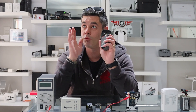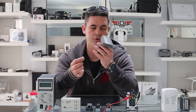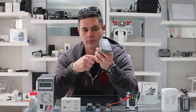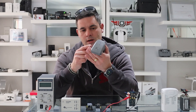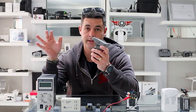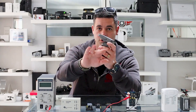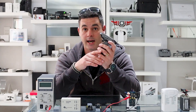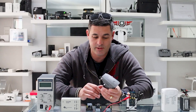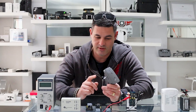Disclaimer: these are LiPo batteries. If you pierce a cell you will burn your house down, so please be super careful how you open them. Don't use steel tools. There are a couple of clips and sometimes a bit of glue — pop the battery open carefully. If you aren't experienced, please do this outside for your own safety. YouTube LiPo battery fires so you understand how dangerous these are.